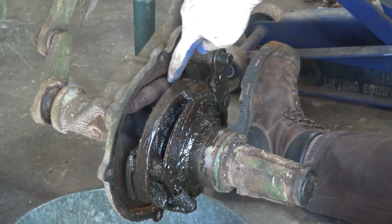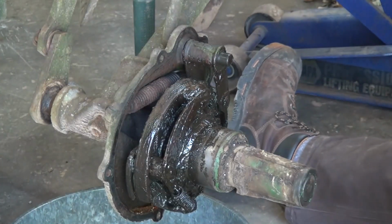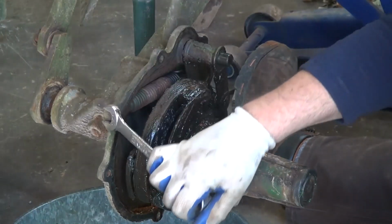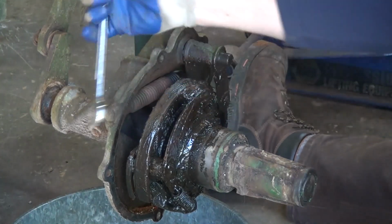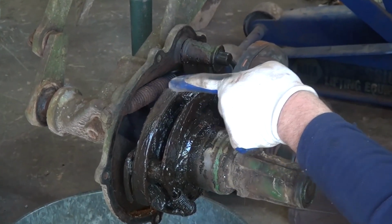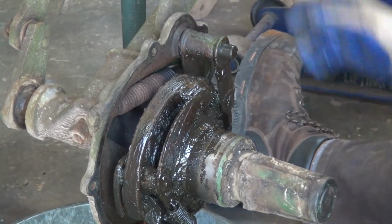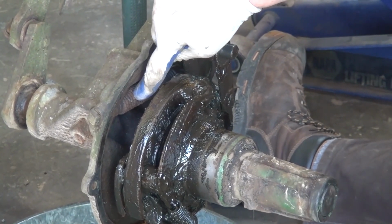And the spring return pressure that I was telling you about earlier, this bolt threads right into this spring right here. So if we want to increase the tension, we simply would tighten this up. Now, it would appear that based on the relationship between the nut and the housing and into the spring, there's really no adjustment left. It's stretched out. You can see the rust pitting on the spring. It's not going to be long before this would break.